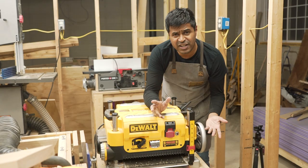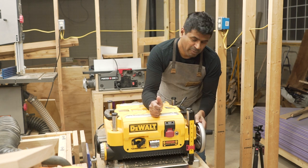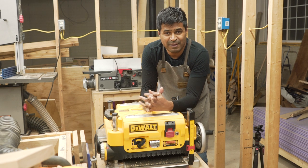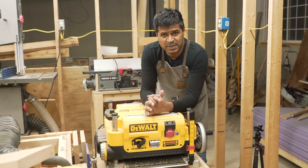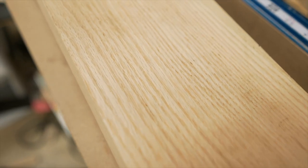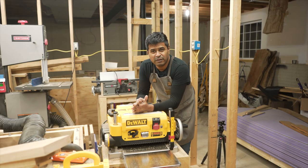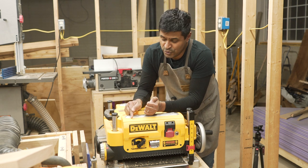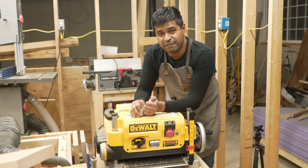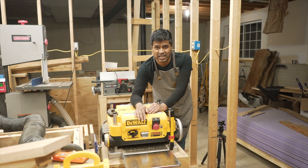I've had this planer for a while now. I reached out to Amazon telling them I didn't get the locking nut — instead of sending me the part they gave me a 10% discount. I still haven't bought the nut because I've been lazy; it seems to work and one of these days I'll find the part and install it. Another thing I've noticed is about snipe — this planer seems to have literally no snipe at all. I take a maximum of about 1/32 inch per pass and don't do any aggressive material removal. My workflow: I start with the faster setting, get to just about the thickness I want, then switch to the slower setting for a final finishing pass. This is a solid, solid planer that has definitely elevated my woodworking game in the shop.